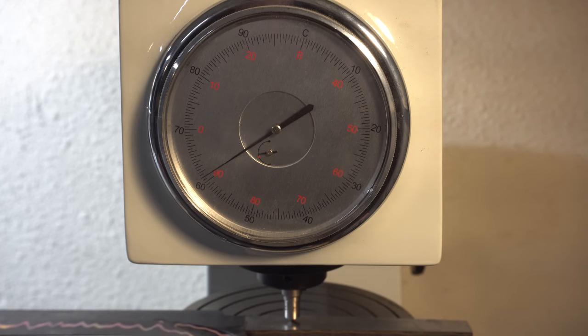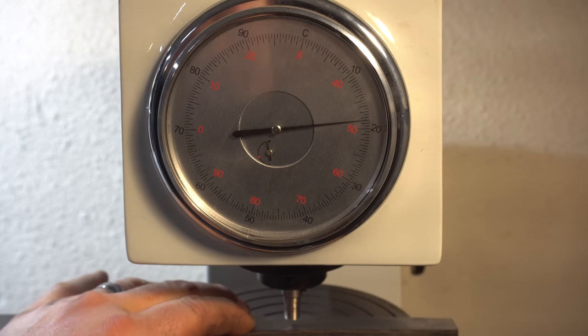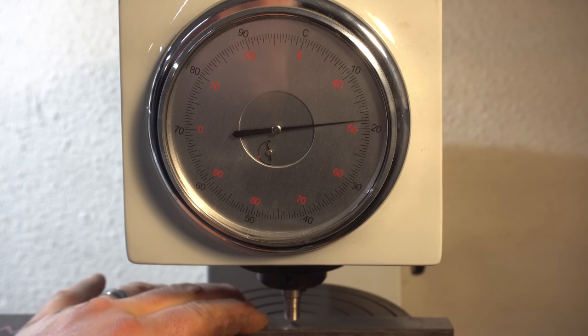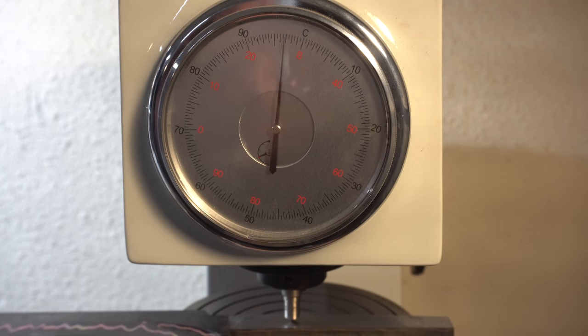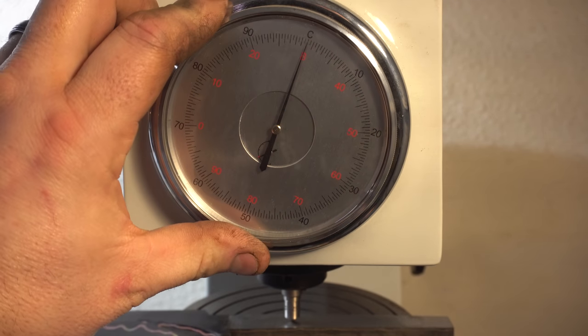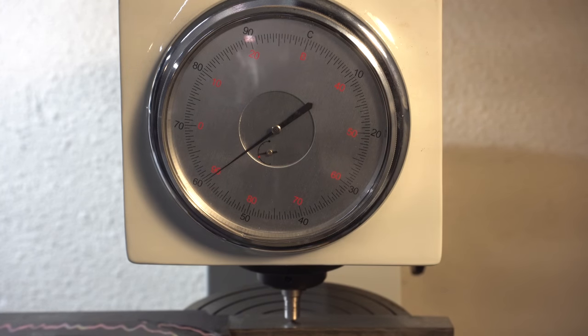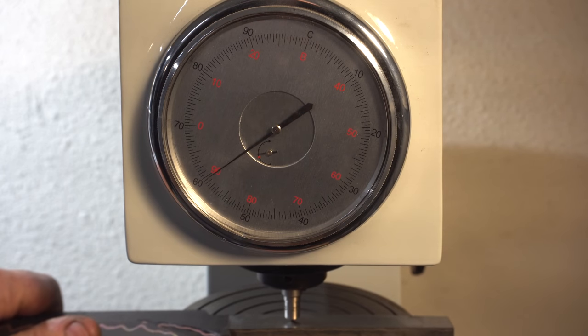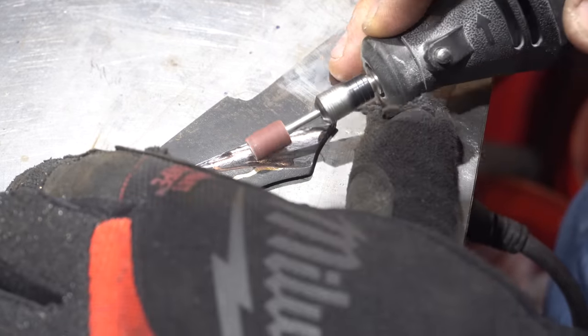61 — it's actually a little high. That one was 59 and a half, so we'll average it out around 60 HRC. I spent a little time cleaning up these fuller areas and then on to the grinding.